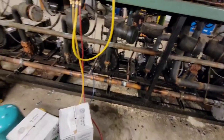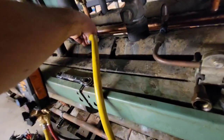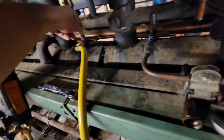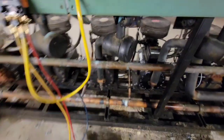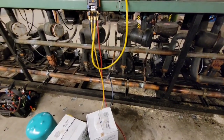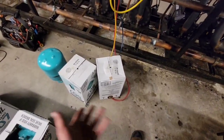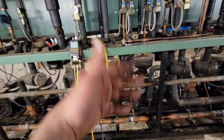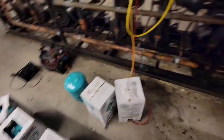I picked up 300 pounds of refrigerant — 100 pounds over there and the rest right here — and loaded it into the rack. Right, wrong, or indifferent, here's how you do it: find your lowest suction group, 20 PSI suction group, plug in your three-eighths hoses onto your service valve, loosen up the service valve, flip them open and put it in. When you put it in, you don't want to put too much liquid in at once — give it a little time, make sure everything equalizes to the same pressure, and ensure the rack has time to boil out all the refrigerant before hooking up the next bottle.